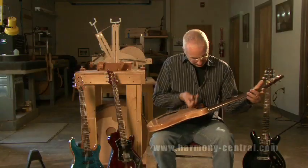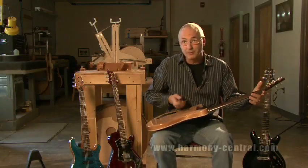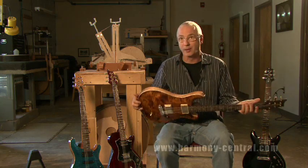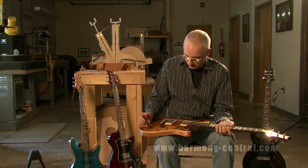We have a very unique drying process for our wood here. We're very careful about the woods we pick. This thing's ringing real nice — you can hear it's all ringing the same note. It almost sounds hollow, but it's not. If the wood's sopping wet, obviously it's not going to ring. If the resins in the wood aren't crystallized, it's not going to ring. What's interesting is even pieces of plywood that have been through our drying process ring after we get done.